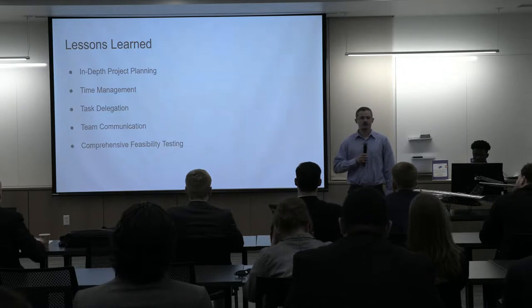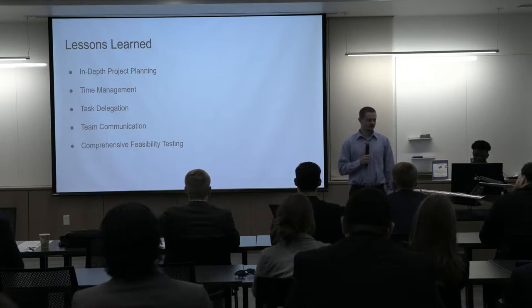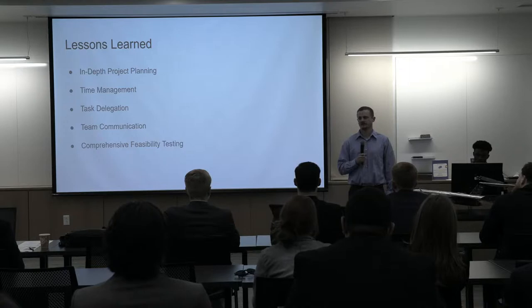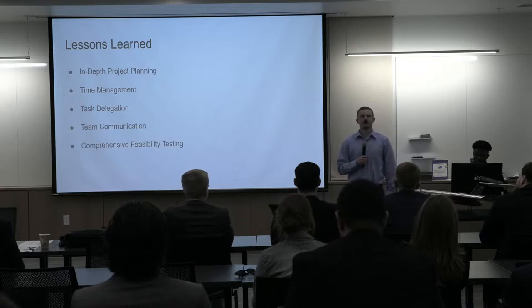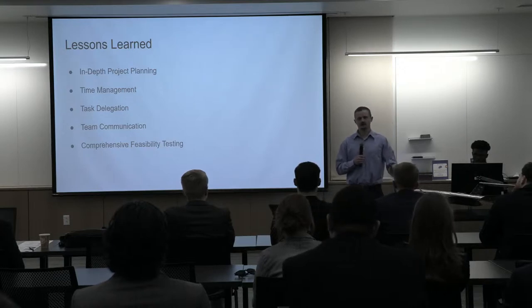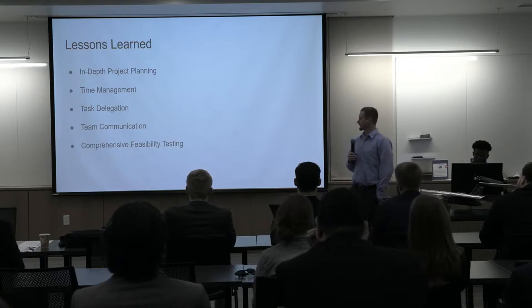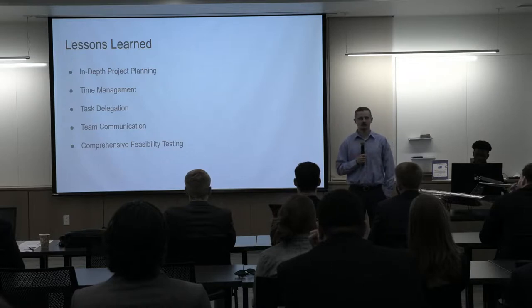Some lessons learned for our project. We definitely want to do some in-depth project planning and some requirements tracking. There were some specific requirements by the SAE that we were aware of at the beginning of Capstone 1 that kind of fell to the wayside. And as we started to design the aircraft, we're kind of stomping our feet: oh, I forgot about that one, we've got to change this design real quick. Maybe move the arming plug back because it needs to be 6 inches behind the propeller. Just little things that would have been simple had we done more thorough requirements tracking throughout the 2 semesters of Capstone. And I think that plays a little bit into time management and task delegation as well.